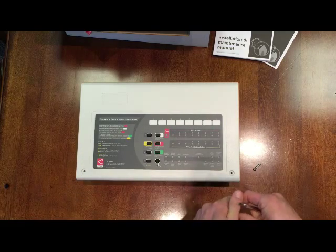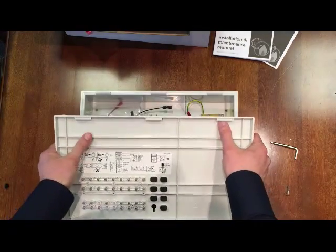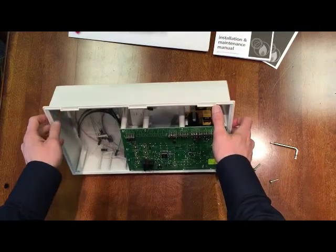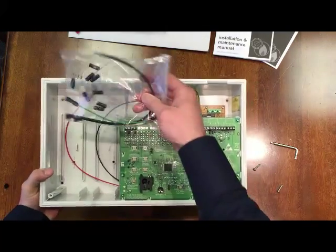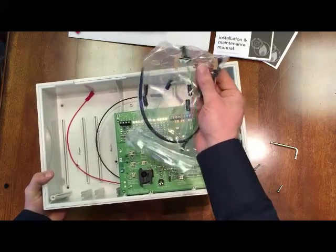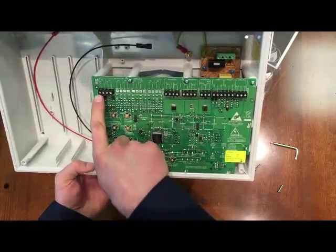This is a brand new panel out of our store so the screws are a little bit harder to open than they normally might be. It just clips off — there are three clips at the top that slot in, that's how you lever the panel on and off. Inside the panel we get the capacitors for the end of line for the detection circuits, and the end-of-line resistors for your bell circuits.